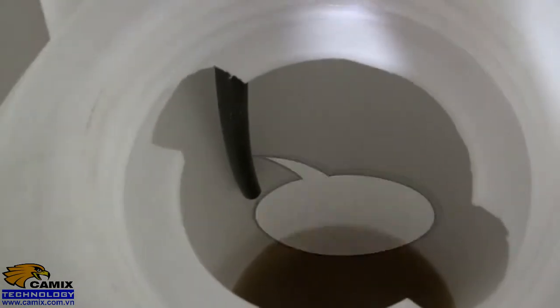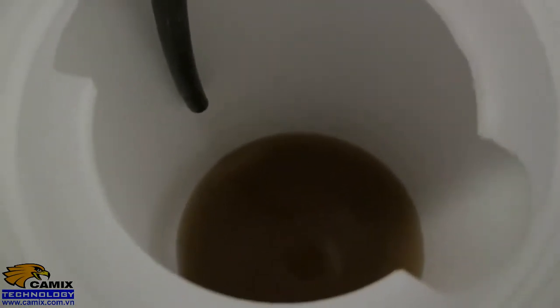Here we're having a look inside the tank. What you see down there is the water from the well. The first thing after I reconnected everything was turned on the pump briefly. There's quite a bit of murk in it, you could say, and that's mainly from this poly line that I moved and knocked a lot of stuff, sediment I guess, off the inside. I ran it until it ran clear, and this is what I have. Now I've got to pump this out of the tank.